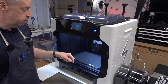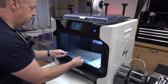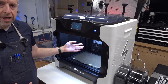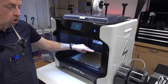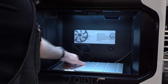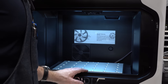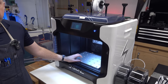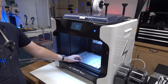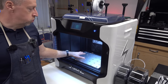I bought that second plate for production printing, so I can pull out a plate of parts while it's still hot and firmly stuck, throw another plate in, close the door, and start a print without going through the full preheat cycle — because the printer and aluminum heat bed are already up to temperature. The aluminum heat bed has a PC board heater with an integrated thermistor on the bottom, and in my experience it's really, really even — unlike glass beds with PC board or silicone heaters.